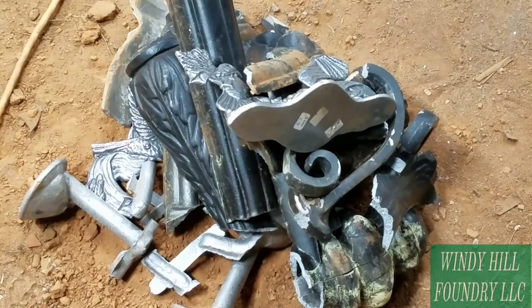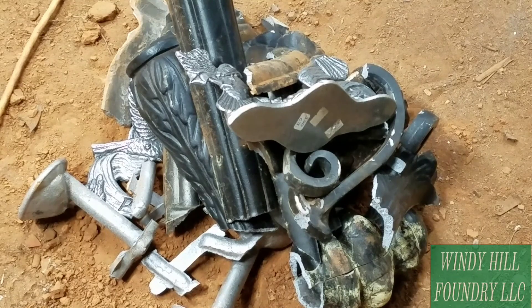This is A356 alloy aluminum. I don't use pop cans, extruded aluminum, or any of that mess — I stick with this alloy for just about everything. The other stuff will melt and shape, but it's not durable. It's kind of useless for what I need it for.